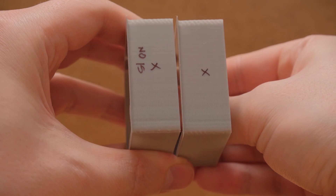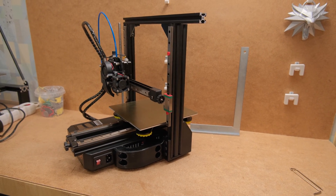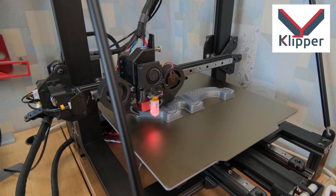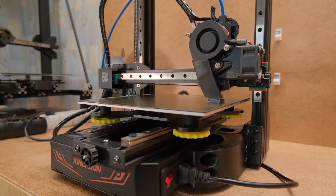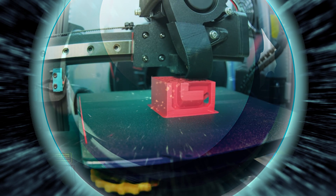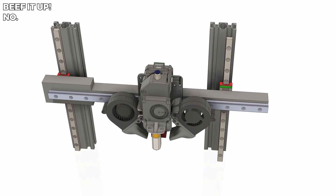If you already have a cantilever 3D printer, are dual-Z rails worth it? It's not a simple modification, but if you can find one that works properly and you also want to transition to Klipper for faster print speeds, then yes. Will it be the most cost-effective way? Most likely no, but it is an option if you don't want to bother selling the printer and enjoy modifying things. However, looking into the future, when printers will be coming with more advanced firmware out of the box, this mechanical limitation will play a way bigger role and could make cantilever 3D printers completely obsolete — because it doesn't make sense to beef up one side when you can support the axis from both ends at a similar price.